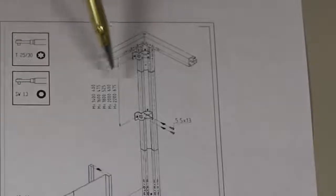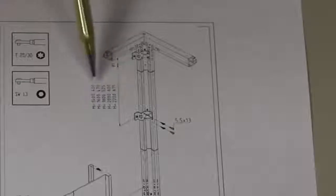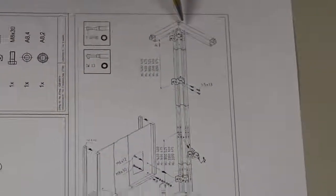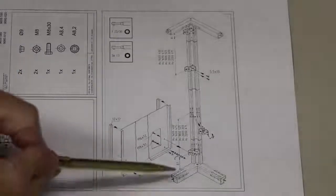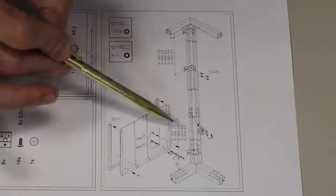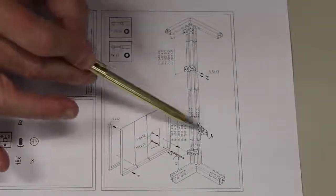From this bracket to that bracket, since the height of my cabinet is 1800mm, I'm going to do 525 millimeters. And then you do the same thing from the bottom — up 81 millimeters, and then the same number, 525 millimeters from that bracket to the center point of that bracket.